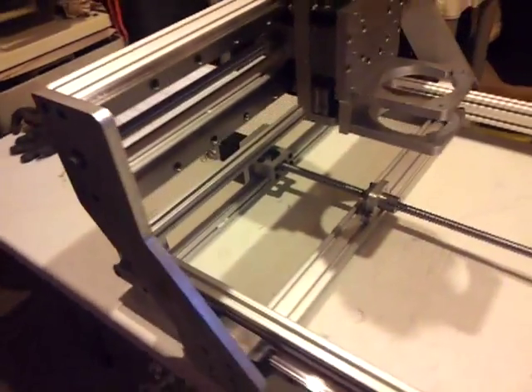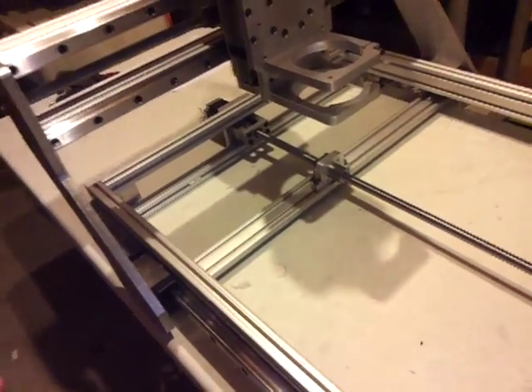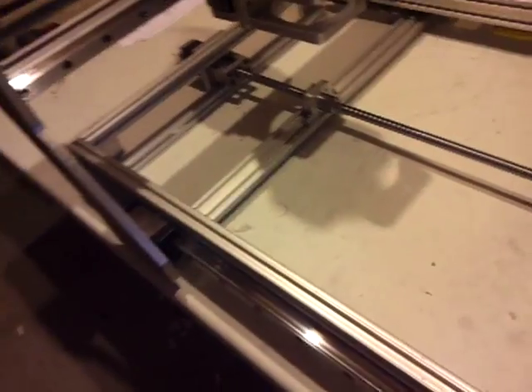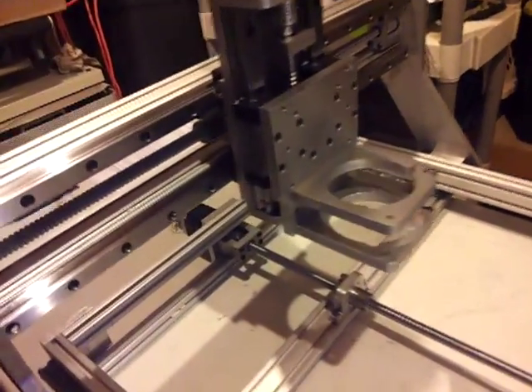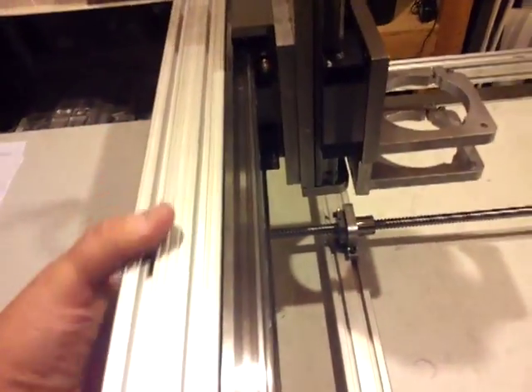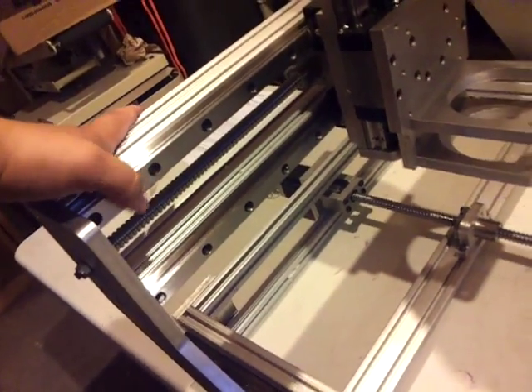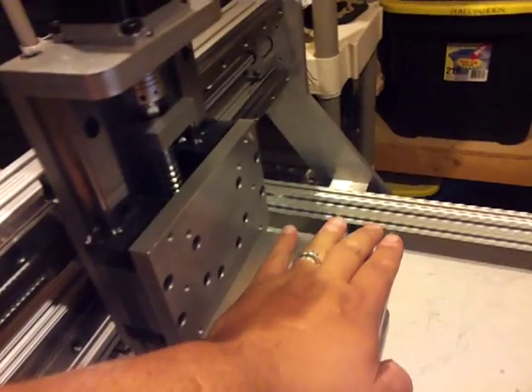The design is pretty nice, pretty stiff. The carriage is on the side here instead of the top, so you're riding on the side. It uses T-slot for the support of the gantry with the rail carriage on the front. There is absolutely no flex in this machine.